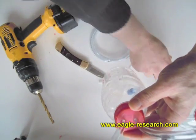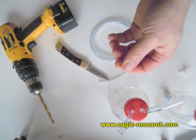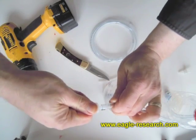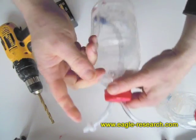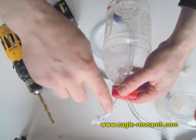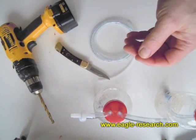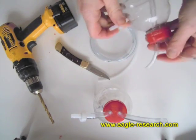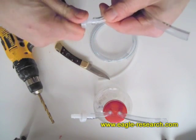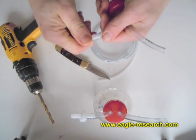Now the hose is going down in. We put the check valve on and you want to make sure the airflow is going the right direction, which is into the bubbler. I'll just check by blowing on it to make sure I get it the right direction. There we go with the check valve in place. You want the gas to go into the bubbler — you don't want the water to come back out. You want the water that's in here to stay in here and not go out to the electrolyzer or wherever the gas is coming from. It makes it easy to know which is the in and which is the out because the in has the check valve.